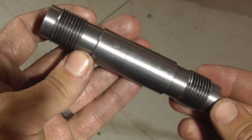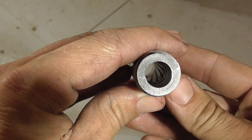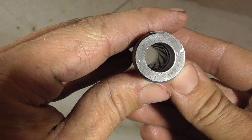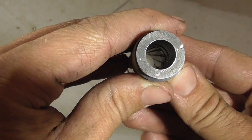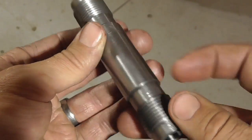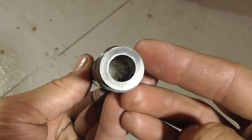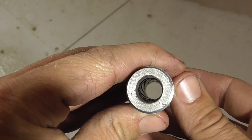Here is our completed monoclinic rifled barrel in .45 ACP. I must say I really like how the rifling turned out, although the rifling button was quite a bit more difficult to drive through the barrel than my standard spline type rifling buttons. I've cut threads and chambers on both ends of the barrel so that I can fire rounds through it in either direction.